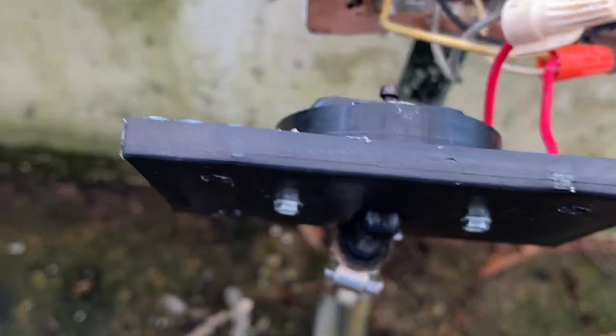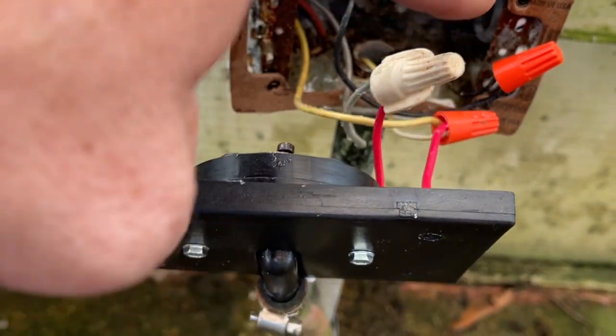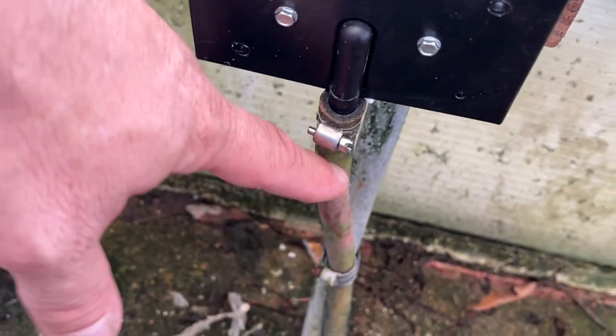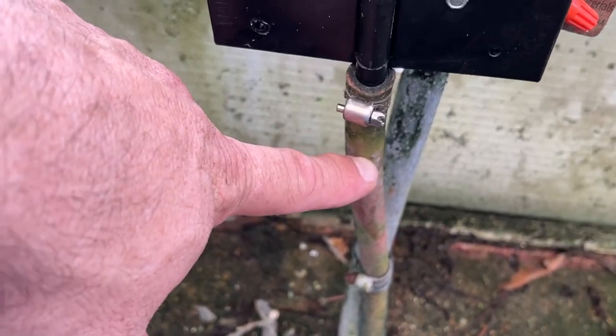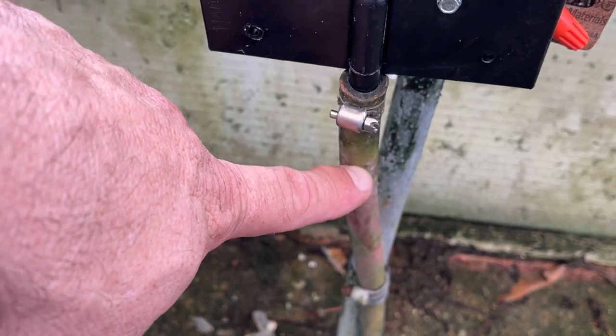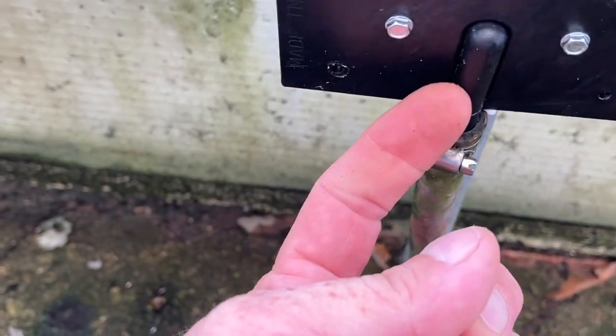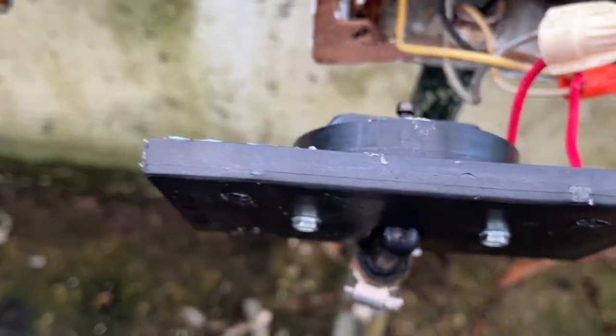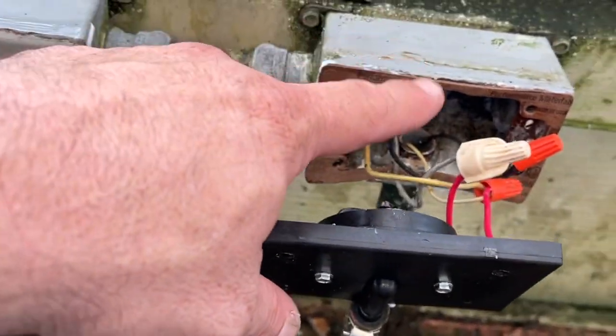And what happens is, when the treadle is hit, it activates this and sends the signal. The next thing, and you can see why there's two, is your backup bell. And the backup bell is this tube. If you see here, it's full of air. Whenever you run over this squishy tube, air is pushed through this port and makes these two connections right here. So the air is what connects these two, and that does your backup bell. So it's only one plate. This is just another connection of wires, but this is really the magic of the whole thing. And that's on this left side, on the driver's side.